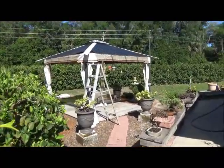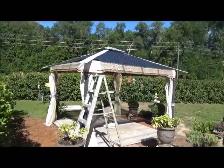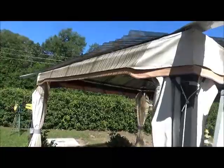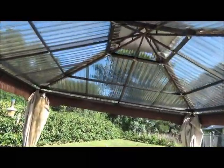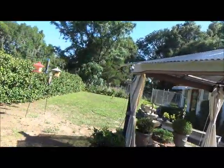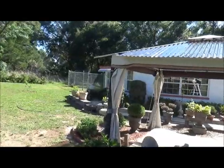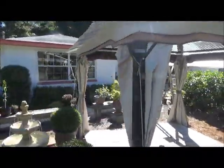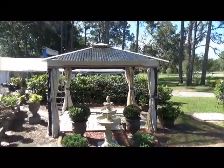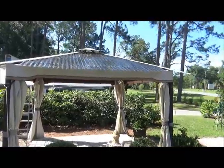All right, another morning. Getting a late start, had to go shopping, get some other things done, like washing the car for one thing. Anyway, I've got the corner pieces on, and I did mention that that was a 45 originally, and it was a 90-degree bend that I had to open up to roughly a 120. So I don't know what I was thinking about the wood cut, which the wood cut for the beams I put in was a 45 degree and a 15 degree compound cut.